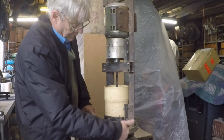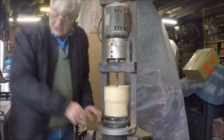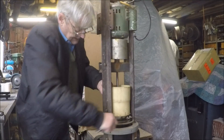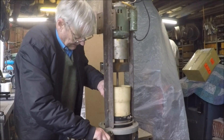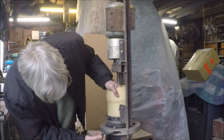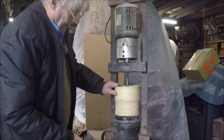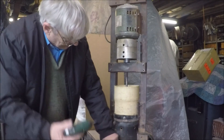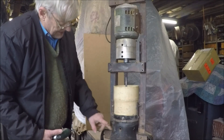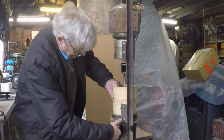Now, there is a ring of stationary rods on this piece of aluminium here that are pointing in radially. To take this off, I first have to remove some of these rods because they won't pull out through this piece of rubber if I don't. This aluminium ring is capable of coming off when I undo the bolts. The rubber's a good idea, because the sand when it's being agitated will damage just about anything, except the rubber is very resilient to abrasion by the sand. If I was to make this a metal tube, it probably would have worn through several times over.